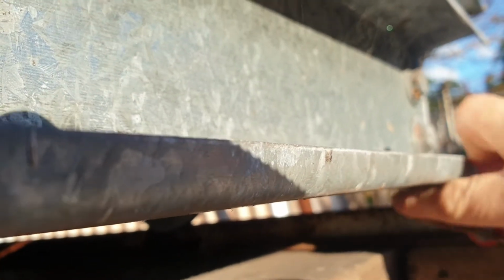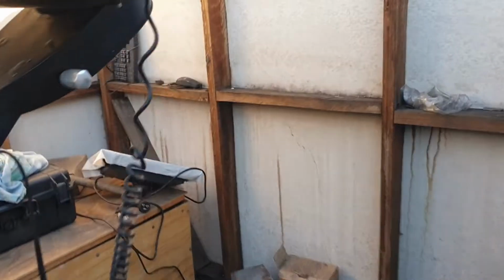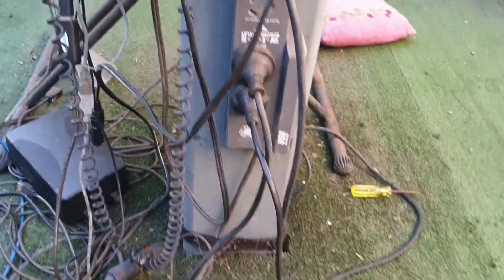This whole observatory is a home-built, designed thing. It's all timbers. My dad's got a sawmill, and he provided the timber. He provided all the floorboards, and I've got a big pier underneath here that I actually bludged from a place I used to work. That's 150mm, I think. I can tell you that because I've got a 6-inch rule. That is 150mm square with a 1 centimetre wall thickness. So it's very sturdy, and it's filled with concrete. And it goes about 800mm, 80 centimetres into the ground.